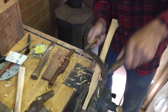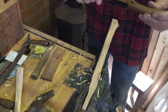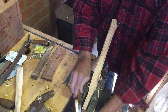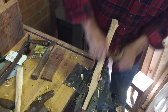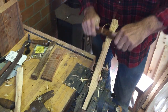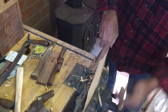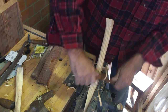When you get the majority of it down and you're ready to start on some of the finer stuff, you can use a spokeshave. This is a really old spokeshave — it doesn't even have any adjustments. I just tap it on the steel to open it up, sight down it, push back down — as simple as that. You can see how effective it is; it's a very efficient tool for rounding quickly. I'm using the vise here, but you could easily use a shaving horse as well. I have one out back, but today I feel like standing.